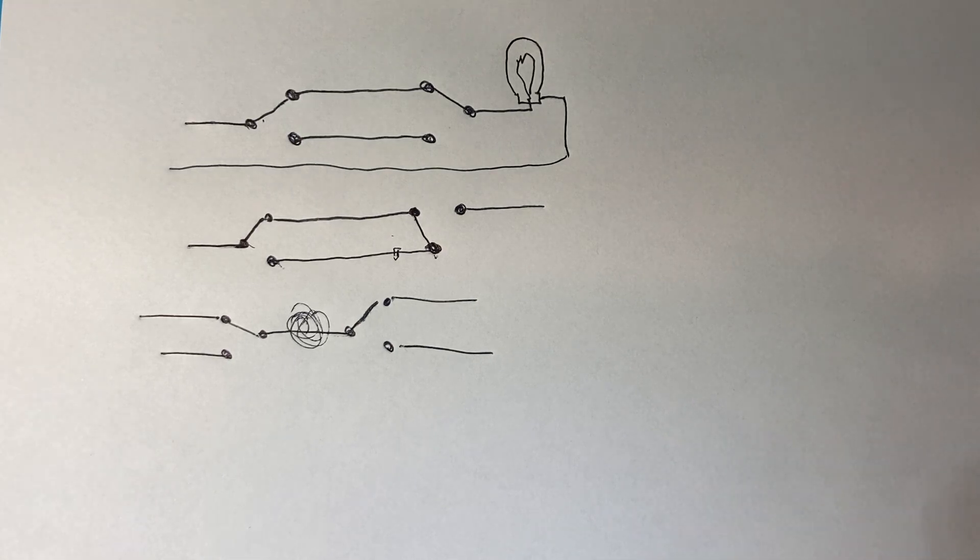I can't see how it ever worked, although I'm told it kind of was. Two other mysteries we didn't solve: the 60 volts everywhere - I Googled it and it seems people have seen that situation with switches that have a neon light to illuminate them in the dark when they're off. When those fail, they act like a half-wave rectifier diode and cut the voltage in half. That's probably not it in this case - maybe there's another load somewhere, or the compact fluorescents in the fixtures are doing something. The other mystery was why the inductive pickup was going off in that one box with the power off. Looking at the video again, you can see there's a bundle of cables, so there was probably another live circuit right next to the switch leg coming into that box - and that was causing that problem. Okay, that's it - thanks for putting up with this coda and we'll see you on the next one!